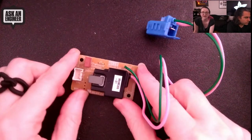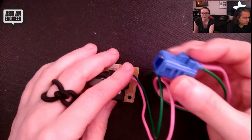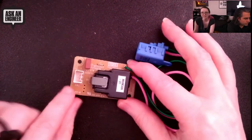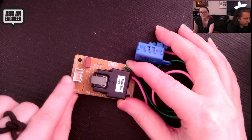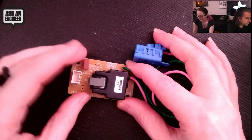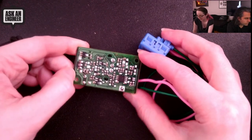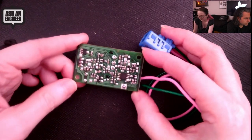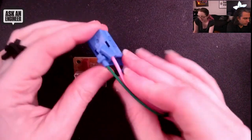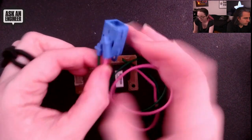So this is just the ionizer module. I plugged it in, but you can't see anything. If you smell it, you can tell it smells like ionizing, ozone-y. Power is here: you connect a JST connector here, and I have the part number in the blog post. It's also in the data sheet. This is a high voltage section, so do not touch this part. You would want to mount this off of your board. Green, I believe, is earth ground connected to this ground, and this is the high voltage pin.